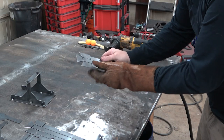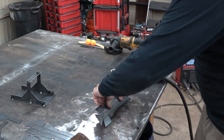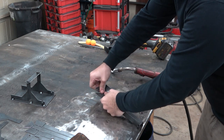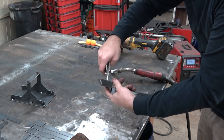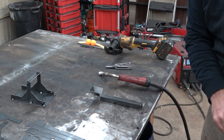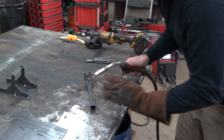For our arm, the wing pieces are going to fold down — that makes a U-shape right there. And then the little throwing arm pieces come up to 45 degrees. If you're having trouble bending them, a wrench or a pair of pliers will make your life a little easier. These have some adjustment in them — you don't even really have to weld these out, but we're going to just to get more welding practice. We're just going to tack everything together to hold it into place. If you want to, you can weld out as much of it as you want to. Then the arms — let's put a couple of tacks down the length.